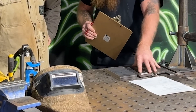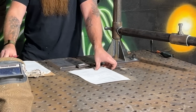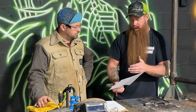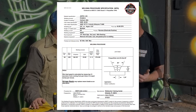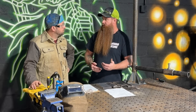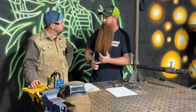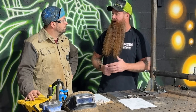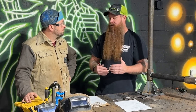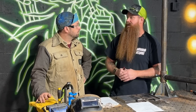You're going to tack these plates up and then I'm going to come over and verify that the fit-up is correct. We're going to go over the welding procedure specification — you have to weld within the parameters of this document. If you weld outside of these parameters, it's a fail. Right after that, we're going to talk about the root pass. Once you put your root pass in, I have to come over and inspect it, looking for lack of fusion or any other discontinuity. If you pass the root pass, you go on and finish — put your fill and cap in.